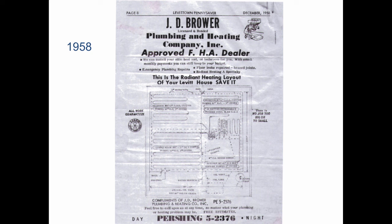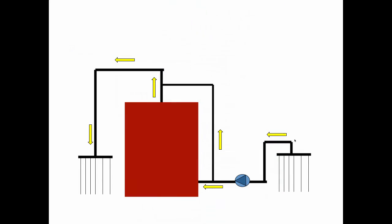And then she goes over and she turns up the heat. She says, "I always run the heat to dry the floor before the kids get home so they don't mess it up." And she says, "I noticed that the floor always dried in these lines. I guess that's where the pipes are. But over here you can see it's drying in a big circle. So that must be where the pipes are broken." And sure enough, that's exactly what he found. So he says, you can learn something if you just listen to people that don't know anything about heating. Sometimes it's just common sense that helps you out on a job.